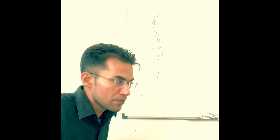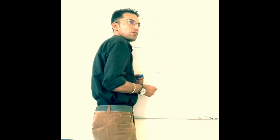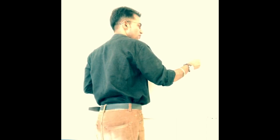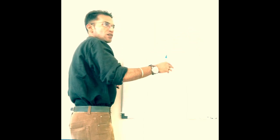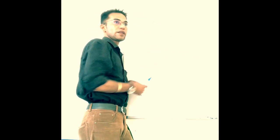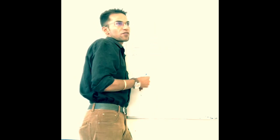Depending on the type of cutting you need, quite naturally, you can cut any sheet metal straight, you can cut it in a curved form, or you can cut it curved in the other direction. So this is your left hand curving and this is your right hand curving. Either you can cut it in the left hand direction or in the right hand direction. Now the question is, do I need different types of snips for left hand cutting, right hand cutting and straight cutting? Yes, definitely. For straight cutting, I require a different snip, and for curve cutting, I require a different snip.